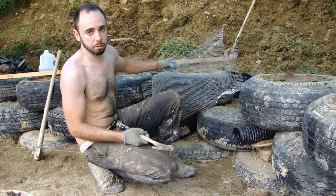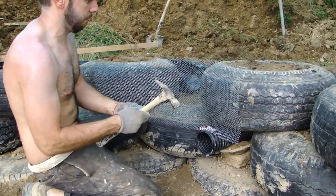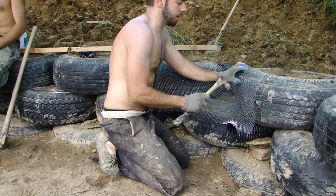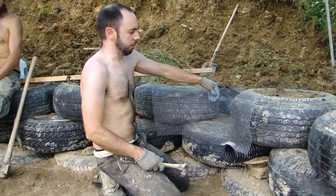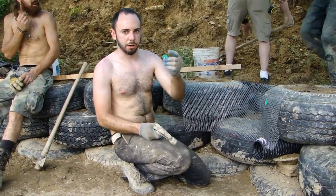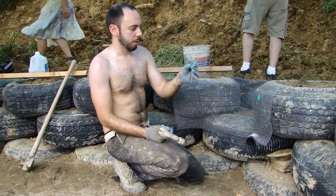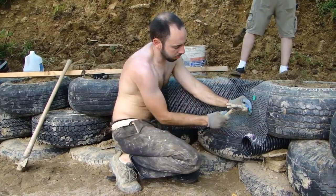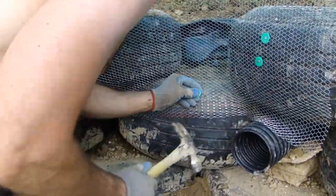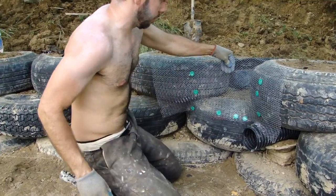To compensate for those small gaps you need to put in a concrete filler block. We're using lath formwork on the front face of the tires — just take a piece of lath, stick it up on the tires, and tack it with screws or nails. When you pour concrete in, it puts pressure against the lath, and if it's not tightly secured it'll blow out and your concrete will spill everywhere. We're using roofing nails with a washer — the nails we used before had too small a head and the lath was popping through. Push the lath into the corners to fill any voids.